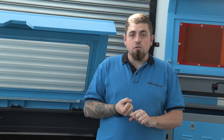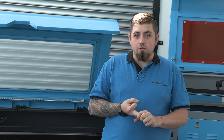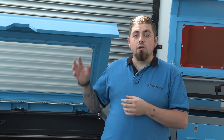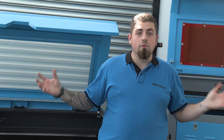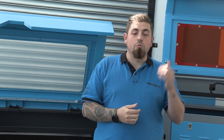So you can do wood, glass — you can't cut it but you can engrave it. You can do perspex, cut it, engrave it. You can do a lot more in the plastic range, and even rubber can be done with this. You have a lot more options to choose from when you are doing CO2 versus a marking tool, such as our previous video.